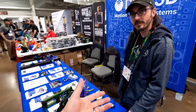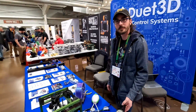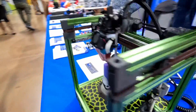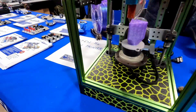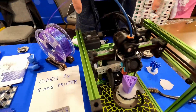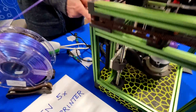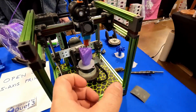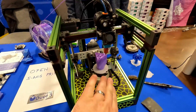So what did you have to do to take a normal V-Zero? What have you changed here? We had to add some stuff — obviously we were adding some axes. We added the B-axis here and the C-axis and this gantry in the middle. In order to make that fit, we had to add a second Z-lead screw and push them to the sides so there was room for steppers in the middle. So now the bed will spin and it will also pivot, right?